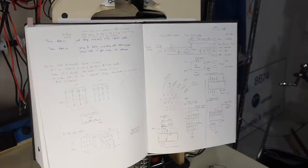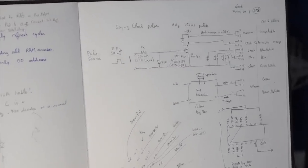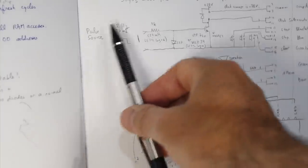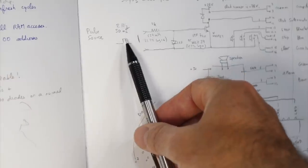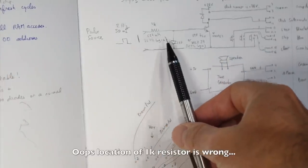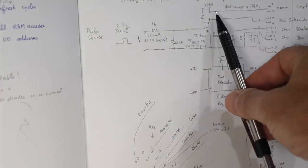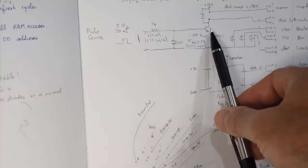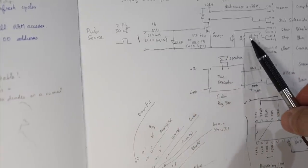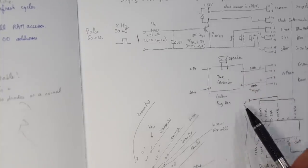In this case, it's a very simple circuit, so I didn't need much preparation. The only thing I doodled here is the MOSFET amplifier. I need to make a simple pulser that has 2 Hz pulses at 50 to 100 milliseconds length. And then I need to amplify that so it can drive the magnet at 28 volts, so I just use a little MOSFET transistor. I also decided to put the three buttons for the chronometer and a little sound generator for the alarm clock.